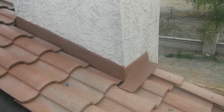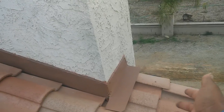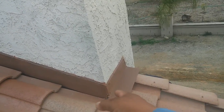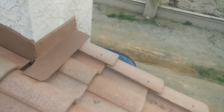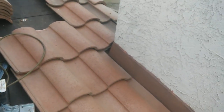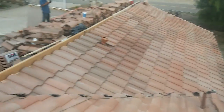This is how I do my flashing — my counter flashing. I'm going to put mortar later on right there. The tile pan is running underneath the tile and the water is going to exit right here — it's going to come underneath this tile. Then right here I'll fill it up with mortar, and that's it. I'm basically done with this fireplace.